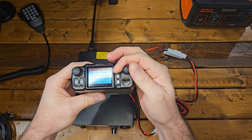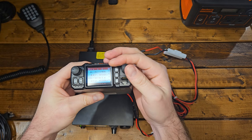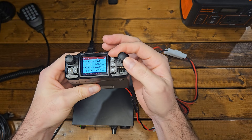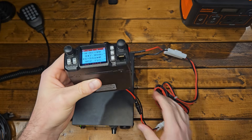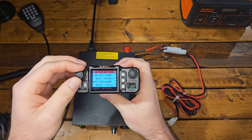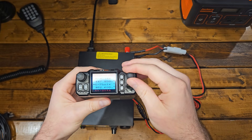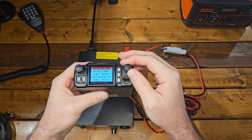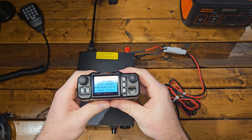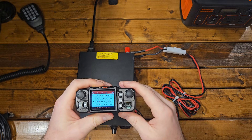When you scroll through all the ham channels in here, you'll eventually get to G — those are the GMRS channels. Anything in the radio marked G with a dash is going to be GMRS, and you should be able to transmit on them with no problem. Read the FCC rules on all of this — everyone always makes a big deal of using a ham radio on GMRS, but you can read the rules and decide for yourself. The reason we don't use a dedicated GMRS radio is simply because you are fixed on GMRS permanently, and a ham radio offers the most flexibility.